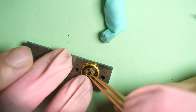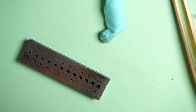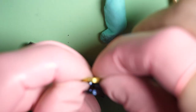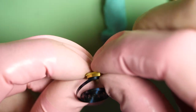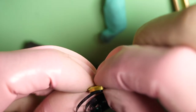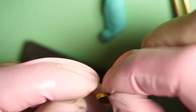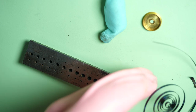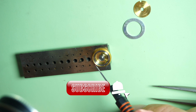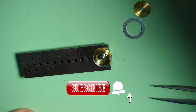The new springs are probably more efficient than this type. The mainspring is a full circle — it doesn't have the shape of the newer type. So it goes all around like a snail. Now I've disassembled everything, and you can see it was a bit broken at the back. So I put in a new mainspring — you can see the difference in color. It was broken, which you could see before I cleaned the parts.